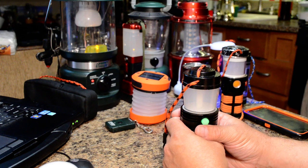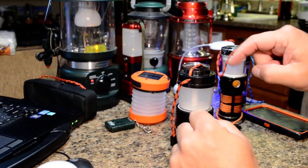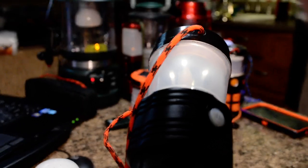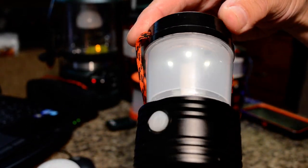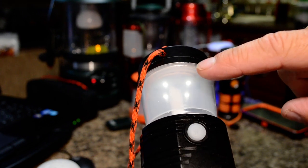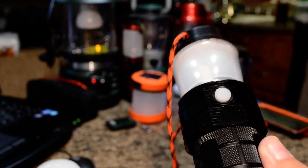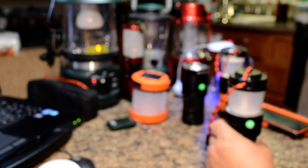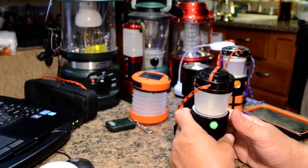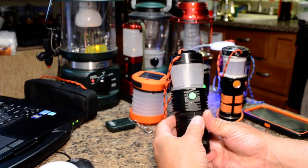The lantern has eight LEDs on top, arranged one behind the other all the way around, so the light is even. No matter which direction the lantern is facing, there are always at least three LEDs visible regardless of the center post — the beam is always smooth. By placing the 5K and 3K LEDs behind each other, as the tint ramps it changes the tint without changing the beam pattern, rather than placing them side by side. That's the advantage of how the board is designed.